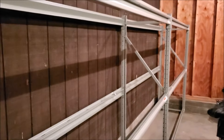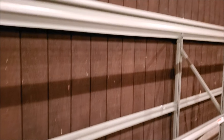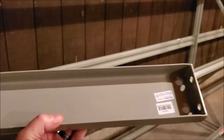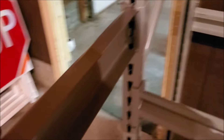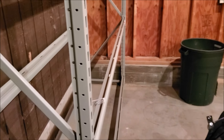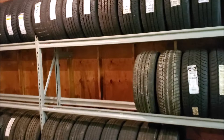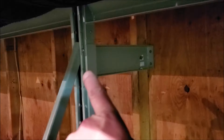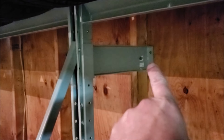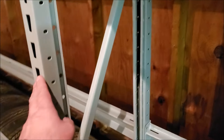What we've got are these tire racks and you can see they're kind of wobbly. These racks come with a bracket to attach to the wall — the bracket looks like this. They just clip in, and these two holes you just screw into the wall. If this was the wall side, it bumps up against the wall and the screws go in. The issue is if we install these onto this leg back here, it's going to push way out into the room and we can't have that. There's one set up in the other room — you can see the rack all set up with that little bracket, about 15 inches, clips in, with a couple screws to keep the whole thing from wanting to tip over.